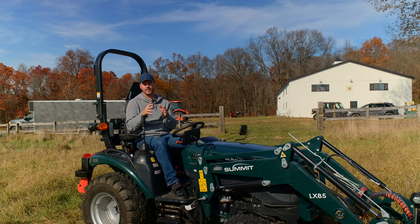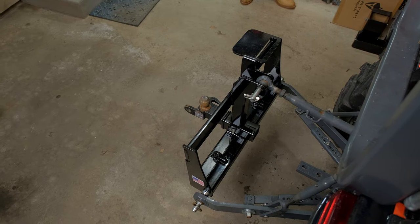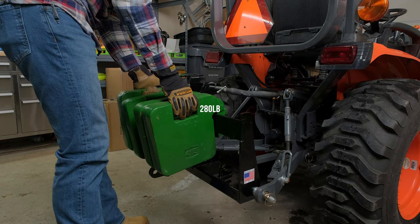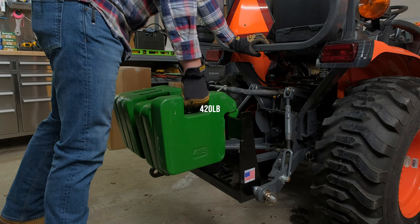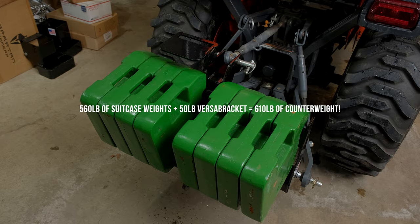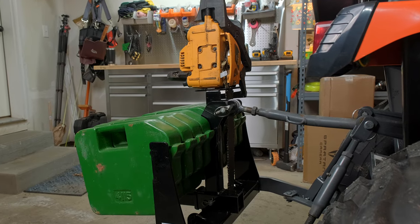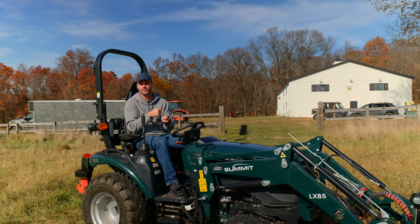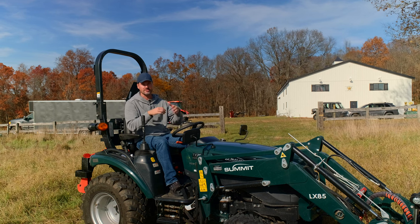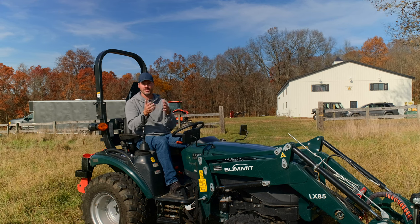One of our very popular setups is the Versa Bracket Bundle. This goes right on your three-point hitch, and not only is it three-point hitch compatible, but it's also quick hitch compatible too. You can buy it as just the Versa Bracket if you already have suitcase weights, or as a bundle. You can get a set of 8 41-pound weights or 8 70-pound weights right along with it. Not only does it add weight way back on the three-point hitch, it's compact, you can take weights on and off individually in 41 or 70-pound increments. It also has a built-in two-inch receiver, chain hooks, and a platform with a chainsaw holder or space to strap down a toolbox.